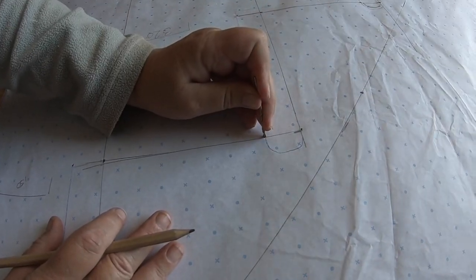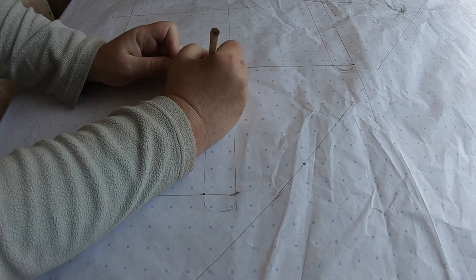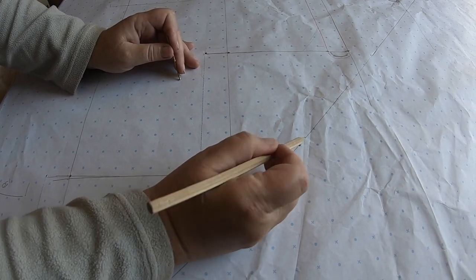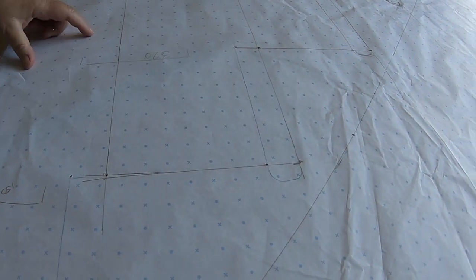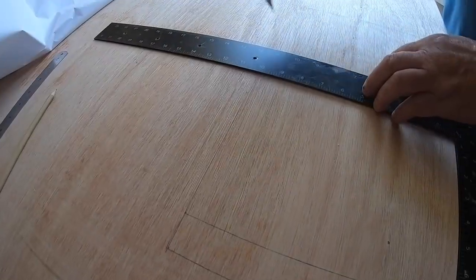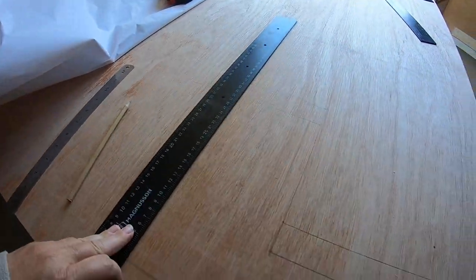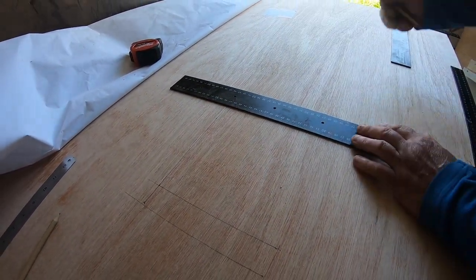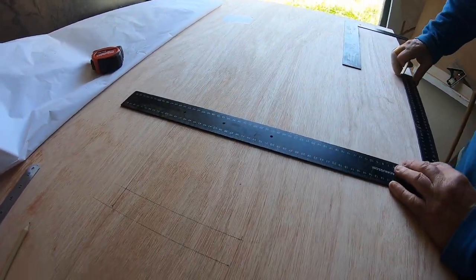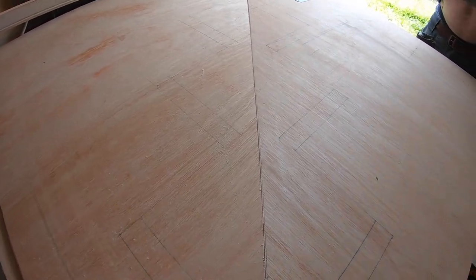I've just used a drill bit to make some marks where the main points are and draw the pencil lines through them. And right on here. And now we've got a sort of a guide of what we want and they're traced through, we can get them square and work them out exactly on the wood. Once we think we've got it right, we just transferred all their measurements onto the opposite side.